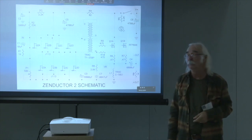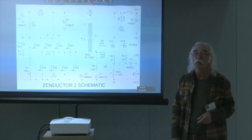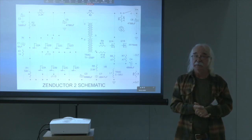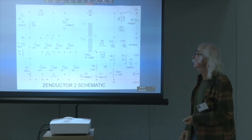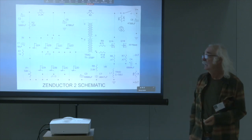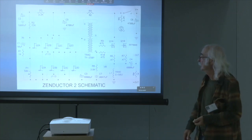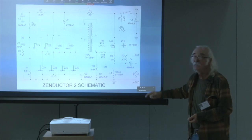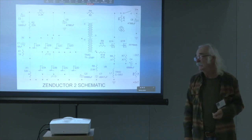The phase has been flipped. The output devices themselves are really happy and deliver a real nice negative phase second harmonic when you run them with the signal out of phase. And their output is also out of phase, and that's why when you get to the output of the device itself, oh, look, this is the negative out for your speaker. Ground is now the positive out. Works like glue, no problems there.